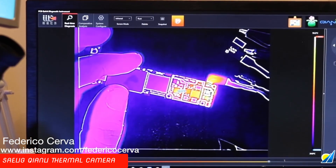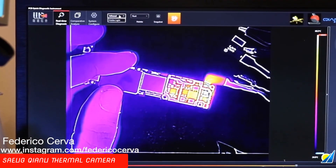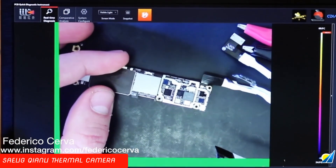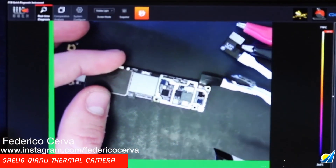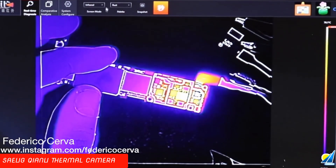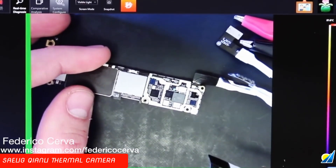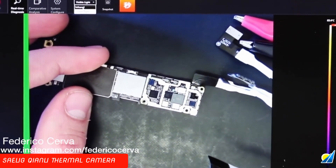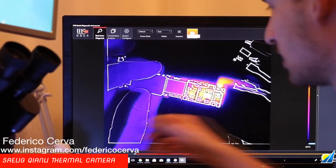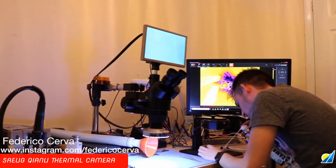We can go out here and we can see the cap is getting hot. We can switch it to normal mode and say, right, that looks like it's the issue right here. If we switch it back to the other mode, we can say, yep, it's right there — it's orange. So we know this is the problem, straight away. Head back to normal mode. Now we're going to turn it off, and just for fun, let's see if that was correct.